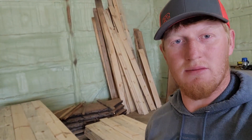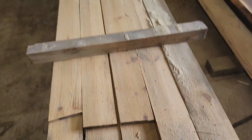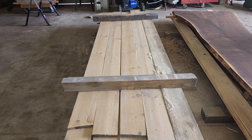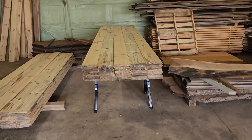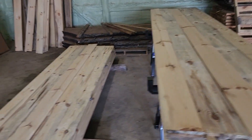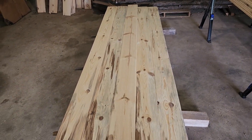I have a molding machine that I make tongue and groove. This is some of the tongue and groove behind me right here that I make. I also have a shiplap, but I don't have any of that available right now. So these are the boards before they go through the molder. I plane one side straight, line rip the edges, and then I can run them through the machine without worrying about any boards having a curve in them — so they're all perfectly straight. I eliminate the curve before they even go through the machine. I don't like boards that have a sweep in them, so these are perfectly straight blue stain red pine, ready to go up.